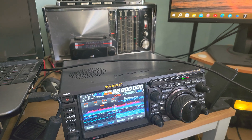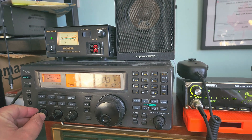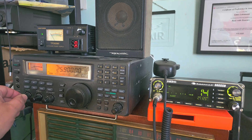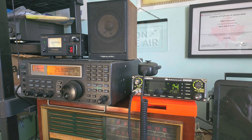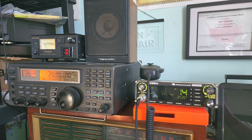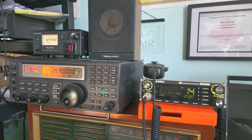This is the BBC World Service on 25900 kHz on the 11 meter band, received on the NFED antenna. Look at the MLA-30 by comparison. One of the observations I was mentioning is that on higher frequencies, my NFED antenna works a lot better than the MLA-30. MLA-30 seems to be a good antenna in noisy conditions below about 10 MHz, but above 10 MHz it becomes equal to my NFED, and on higher frequencies the NFED is actually better.